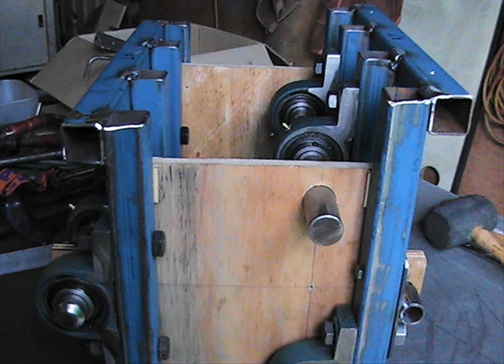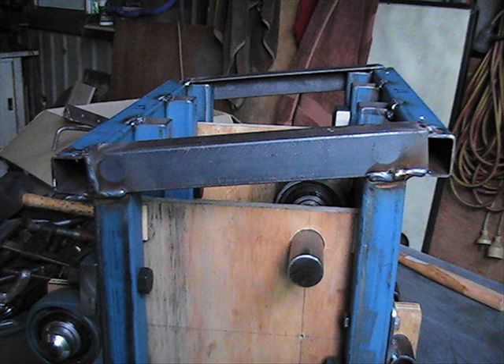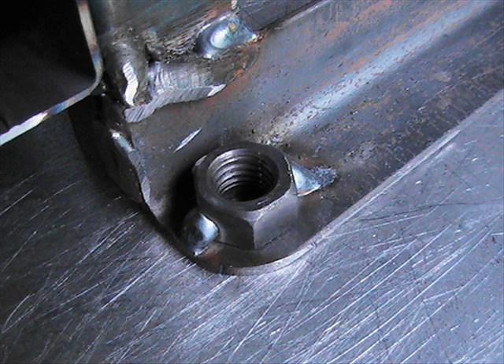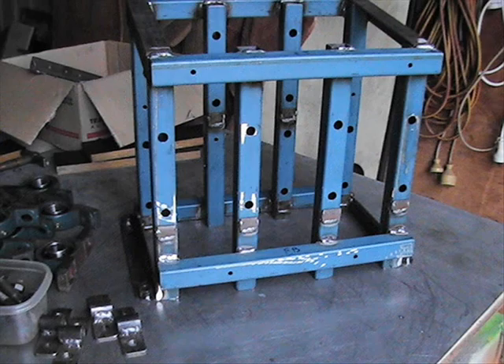Step four: set your jigs back inside the frame to ensure that the front and rear posts are parallel before you weld the top angle bracing in place. In order to get a flush fit, you will need to grind off part of the top corners of the frame to allow for the meniscus of the angled brace. With these angled braces now welded in place, weld pieces of flat bar to the posts to form a locating step for the pillow blocks, and finish off by tack welding in place four half-inch nuts over the holes in the base angle. Well, there you have it — the basic frame for your transmission, ready for the next stage on the construction of the Badger Mark 1 light tank, to be continued in episode two.